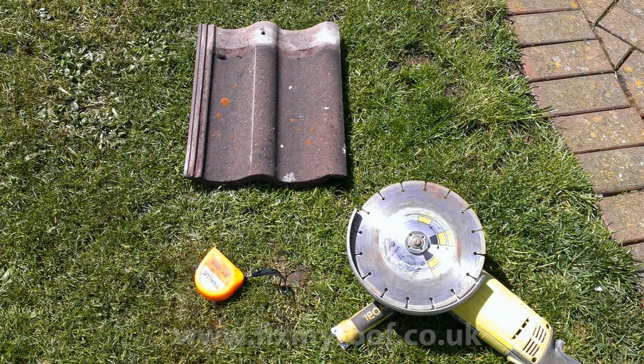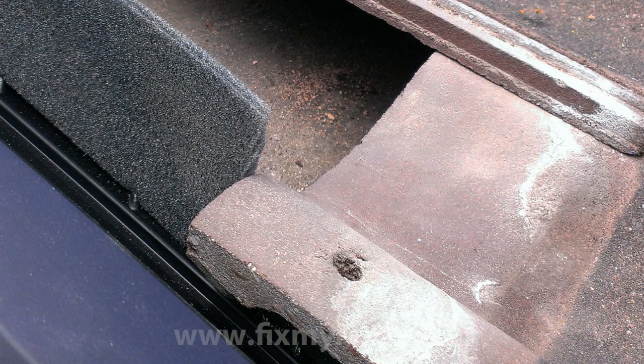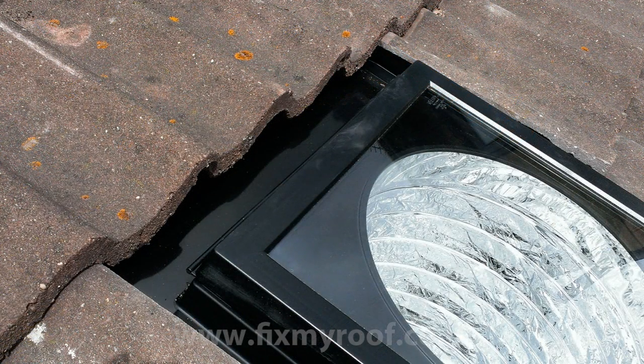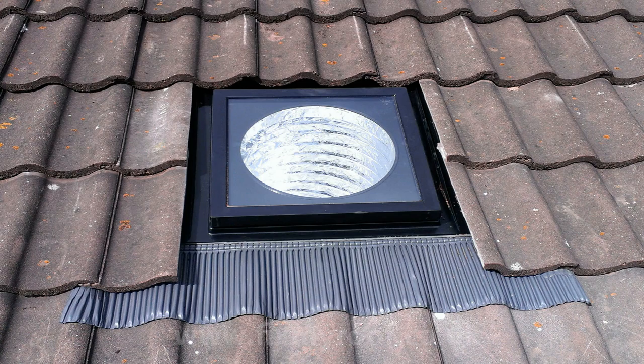Now measure your tiles and go and cut them as necessary. In some circumstances it may pay to trim off a section of the tile if it happens to be in the way of the flashing unit. Now cut the foam so it can exert a gentle pressure on the whole of the underneath of the first tile. Cut the foam to a special shape where the top of the tile sits, so it pokes up proud ready to kiss up to the underneath of the next tile. When one side is complete, repeat the process for the other side. Now set the triangular support bar height so that it supports the underneath of the top row of tiles — the foam may or may not have to be cut here. Slide the tiles back into position to complete the tiling process, then gently tap down the very edge of the bottom window flashing to discourage insects and look neater.